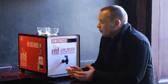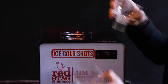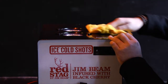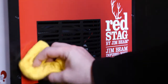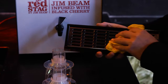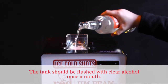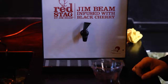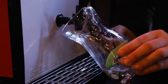So that looks good. But before we use it, and once a month, we need to clean it. Make sure the chiller unit is off and unplug the power. The chiller unit should be wiped down with a clean damp cloth every day. Remove bottles, drain the tank. Pour one litre of clear alcohol into the tank and let it flush through. Caution: do not use water to clean the machine as this could cause serious damage.